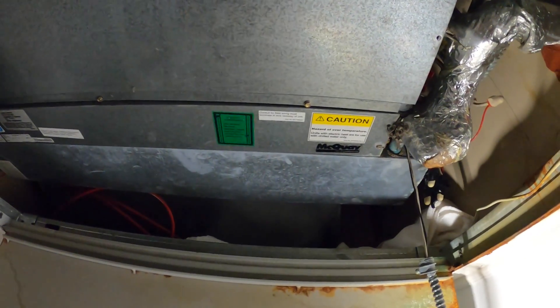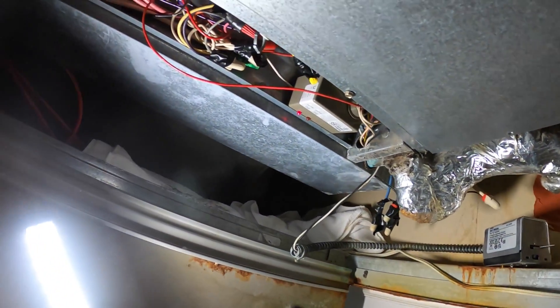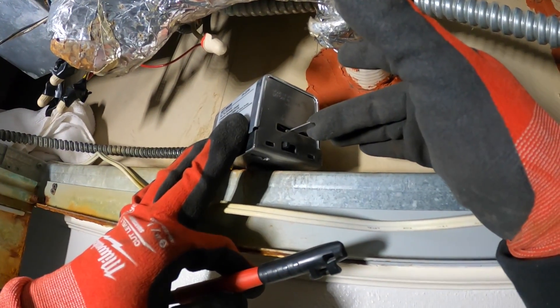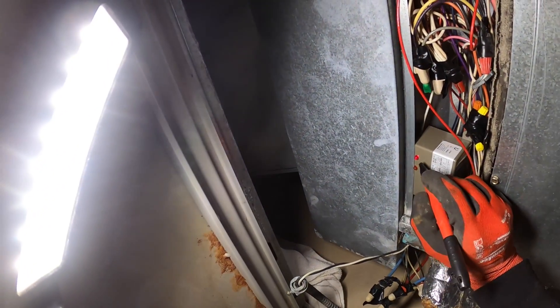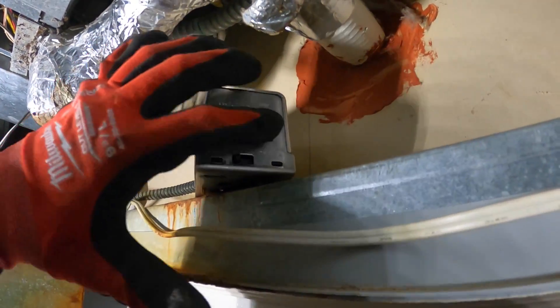Let's go ahead and check to see if the heat is even working here. Let's put the system in cooling. There's a relay here that lights up — I want to know who's who so I can label it. Right now you can see this spring is just tight. One light there, and you can see this valve is slowly opening, which is good. Let's let that fully open before we shut it down. Put a 'C' over there for cooling. See how this is just wide open?